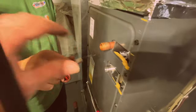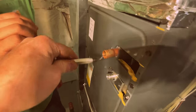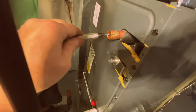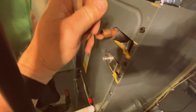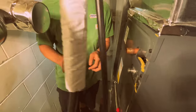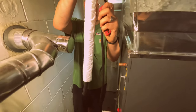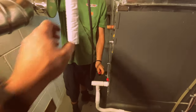Keep going. Here. You're doing this. Grab it and just... And you stick your finger in there carefully. Alright. Okay. Yep. That way the piece will fit in there. Yep, and then take this and then take your knife and run it down there. Yeah, from right here. Not too hard, because you don't want to score that line set. Okay, and then you peel it back.